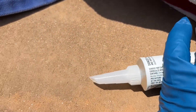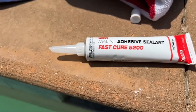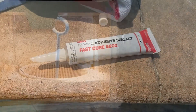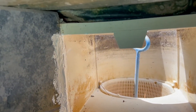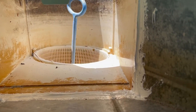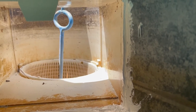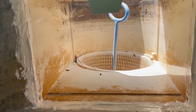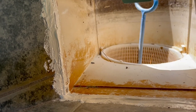We've cut a rather large opening — this stuff is actually pretty thick — and we're going to now take that and put it around the inside. Here is the finished product. You'll notice that I applied it pushing it into the groove, and then I go ahead and take my finger and smooth it out onto the tile and then also into the skimmer throat.